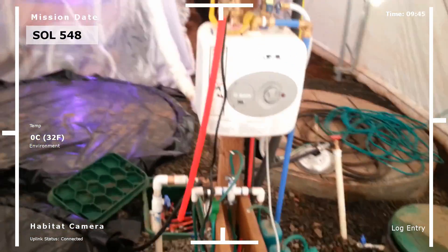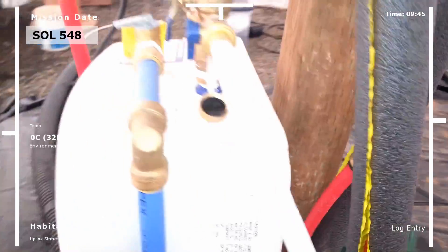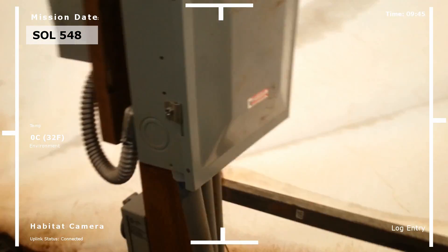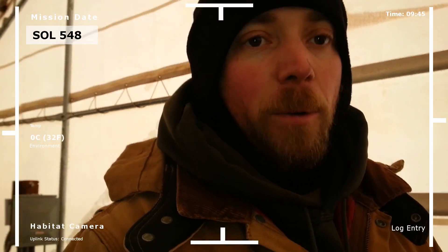All this right here is the heating and methane management system, where we clean the methane, remove humidity from it, and burn it in a hot water tank heater. Then we have our valve system, which is responsible for taking heat and moving it throughout the grow beds and underneath all the fish tanks. Our power input — we have a generator backup system in place. We have a maximum of 40 amps of US power, which is not a lot, and it forces us to find ways to be efficient.